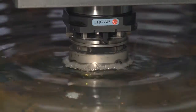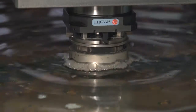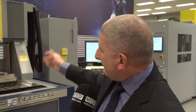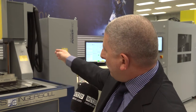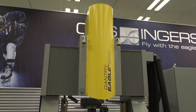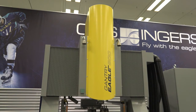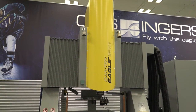On this machine we're capable of moving at 1.4 G's and at 18 metres per minute. When we have a large electrode we have to slow that down. But wherever you see the ram move, it is always supported by four shoes, so there is no elongation of the ram coming out — it's always supported. In the upper head we have a double slideway: one on the top side and one on the front of the machine, which means we don't get any twisting action.